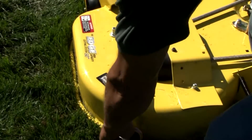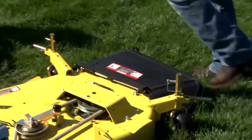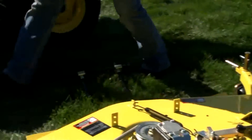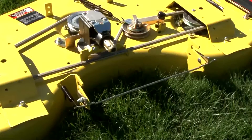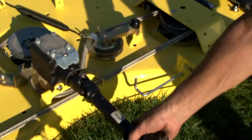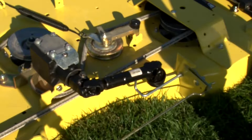When installing the mower, make sure all four mower wheel quick-release pin levers are in the horizontal position and ensure the mower shell is sitting flat on the surface. Also make sure the latch is pushed down in the closed position so the tractor draft arms do not catch on it. If you do not have the optional auto-connect system, ensure the power takeoff shaft on the deck is positioned on the hanger, clear of where the rear draft arms fit into the rear brackets of the deck.